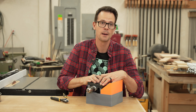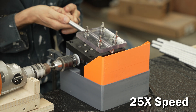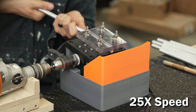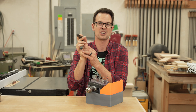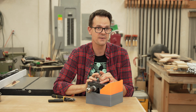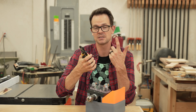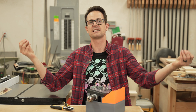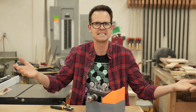So it's twice as fast, and I was able to sit here and cut — I think I cut eight coils in a row and my back was a little stiff because I was sitting there for a while. There's no way I could get through eight coils without my hand starting to hurt. Twice as fast — good. Copper on the other hand takes me the same time to cut copper as it does steel by hand, but in here with the jig, copper I can cut ten times as fast. Then aluminum — it's so fast, I can cut an entire four foot coil in like 25 or 30 seconds. Super, super fast.